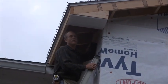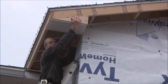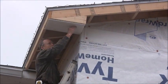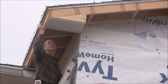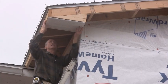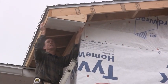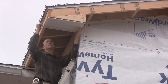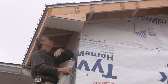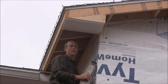In case you didn't see my video on getting your soffit board up, I've got a video out that tells you how to put your soffit board up and put your return on. So you've got your first piece — and I know it droops here and here a little bit — but that's going to be taken care of when you put your aluminum trim on when you put it on your fascia and it'll hold it up, it'll bend it.